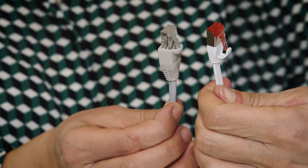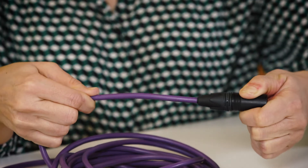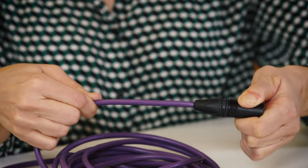When I see people unplugging a connector by pulling the wire, I just want to high-five them in the face with a chair. Luckily, there is something called a strain relief that keeps the connector alive. The purpose of a strain relief is to prevent the applied mechanical forces on the cable from reaching the fragile electrical connections — generally speaking, to provide a smooth transition from the flexible cable to the rigid part of the connector.